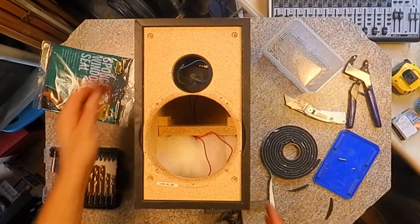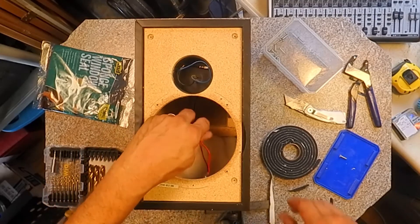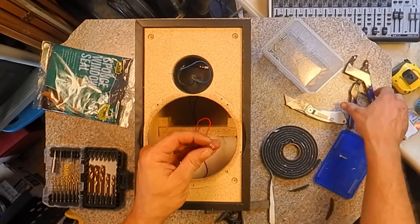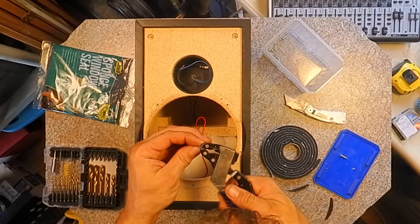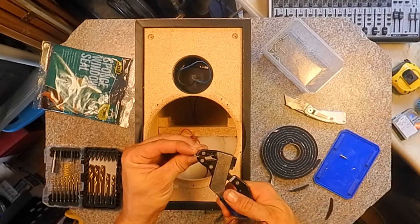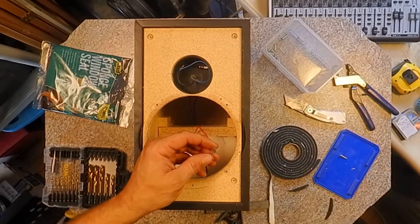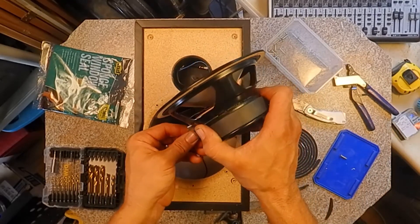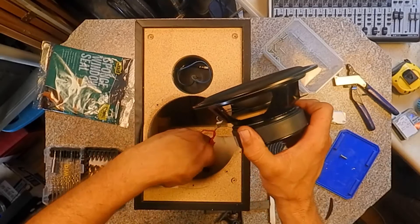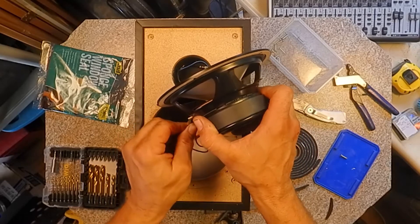Let's get ourselves a woofer to install for good. The hot one is the bigger blade, and the Infinities have a larger blade on them. I'm going to crimp this thing down so it makes a nice, good, tight connection — I don't want it to fall off the speaker. This is the positive — we are marked positive over here. That's a good bite, it'll stay on. This one is actually the perfect size because it's a standard terminal blade.